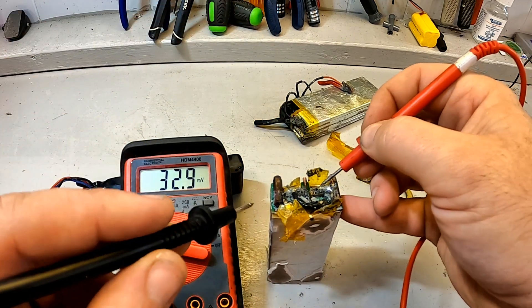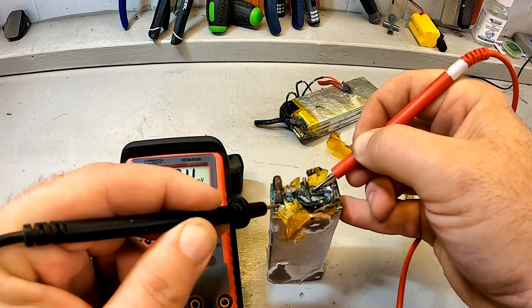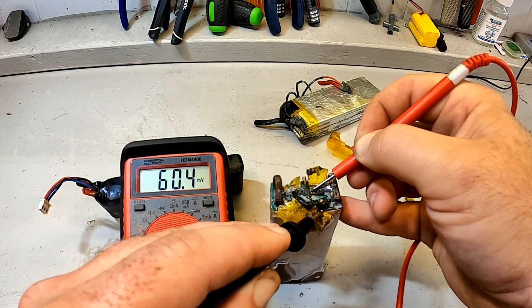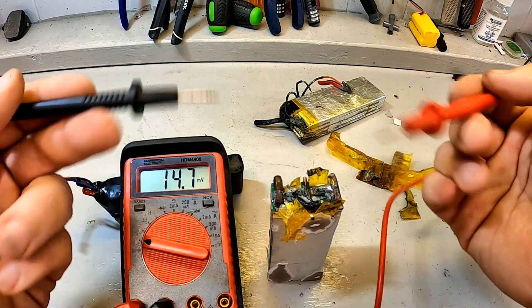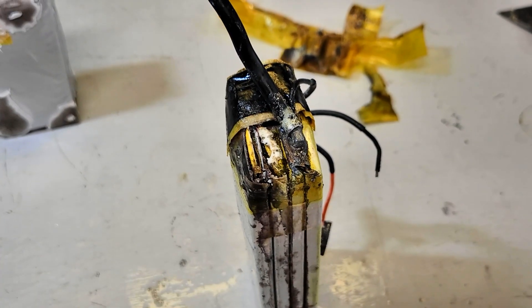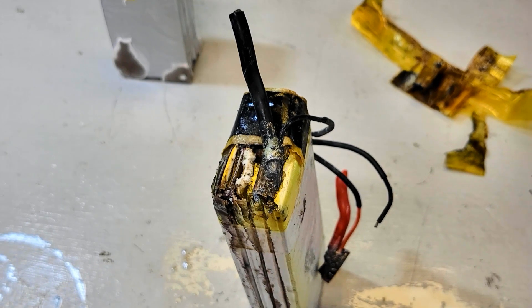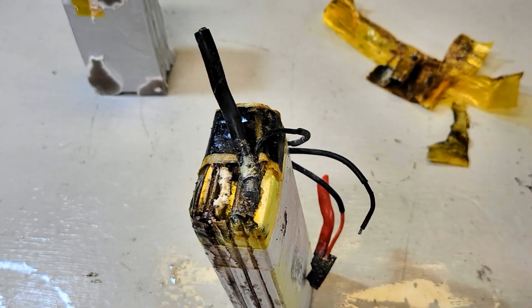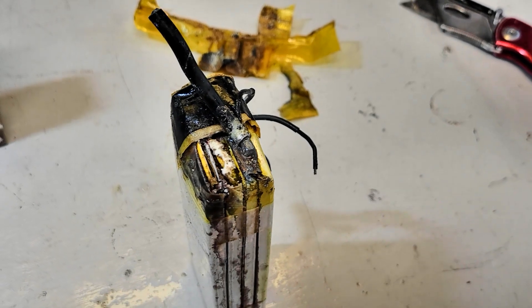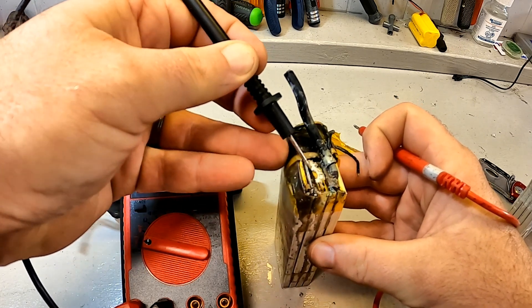When I come across the battery tabs themselves - not through the connectors but off these big soldered tabs on the battery itself - it's showing like 60 millivolts, which is in the range of what I get when the probes are just out in open space. So it's basically dead. Looking at the other pack, one interesting thing: the positive side has literally just come off - the corrosion literally took the whole tab off. So trying to get voltage through the battery will show dead, but is the cell inside really dead or is it just that the terminals have corroded off?